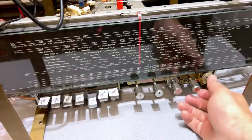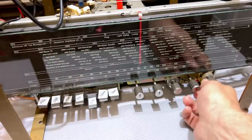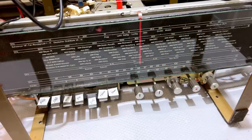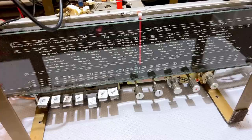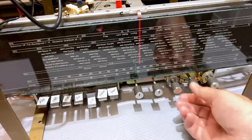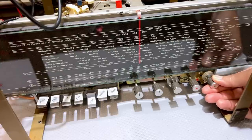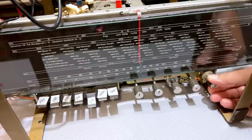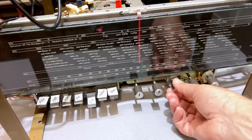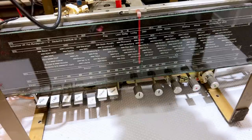They tell us to set the tuning to about 95 MHz, but I've got a pretty strong station there, so I'm going to put it up a little bit more to about 96. At this point I haven't input the signal yet, so all I'm going to hear is hiss.